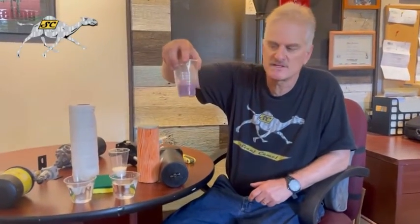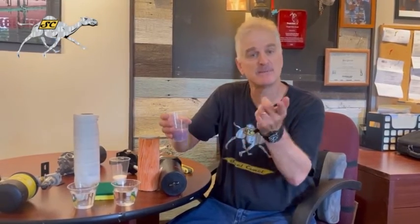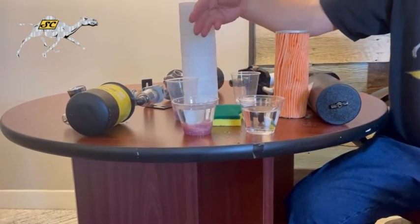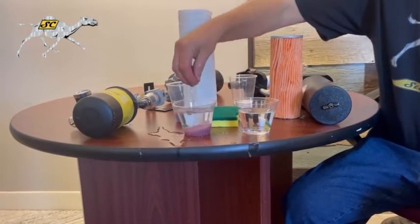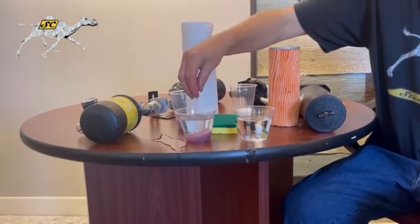So with that said, I'm going to dive right into a couple technologies. As you may know, there's 3 different types of technologies, or maybe 4, to dry air. I'd like to go over a couple of them. A lot of people over the last 50 years have used these little beads, basically little marbles. What they offer is excellent adsorption properties, so the water sticks to the beads. I'm going to demonstrate. Okay, so the beads are in the water. I pick them up, and they're wet. So they do hold the water, but they do drip.